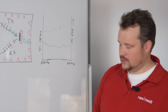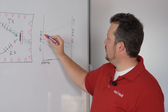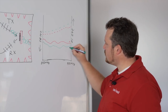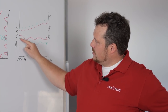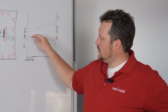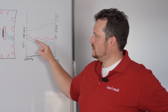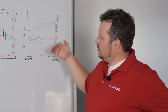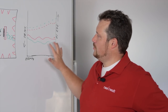A typical comparison of two transponders might look like this: transponder A and transponder B. Transponder B has better sensitivity — it needs less power to wake up over the whole band, so it is lower on the sensitivity axis and therefore better. Its backscatter efficiency — the dashed line — is also better over the whole frequency band. So in this simple diagram, transponder B is definitively better than transponder A.